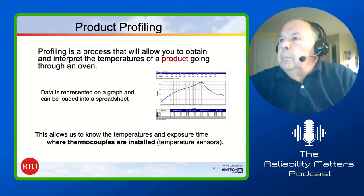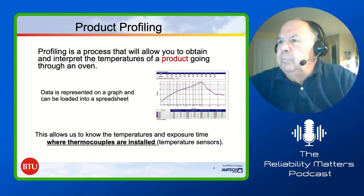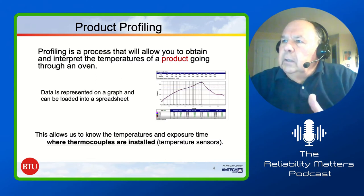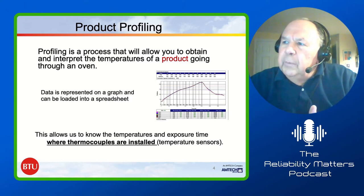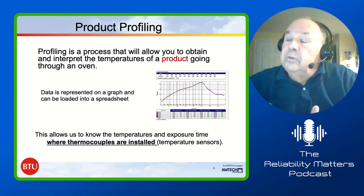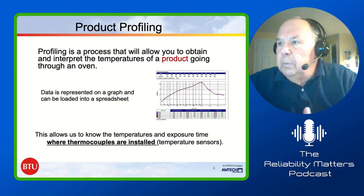Okay. So product profiling, that's really what I'd rather call it than just basic profiling. It's a way to measure the temperatures, interpret those temperatures of the product going through the oven. It's normally represented in a graph, and sometimes it's even put on a spreadsheet like Excel. But it allows you to know the temperature and exposure time of the places where the thermocouples are installed. Thermocouples, temperature sensors. We go another page, please.